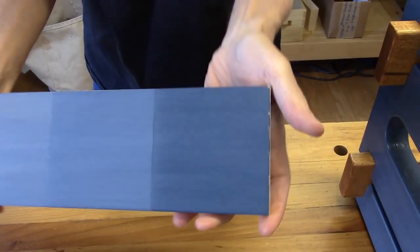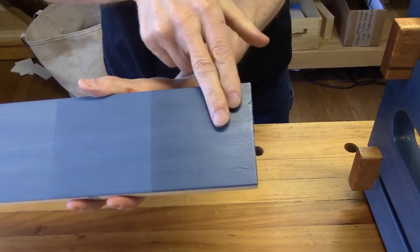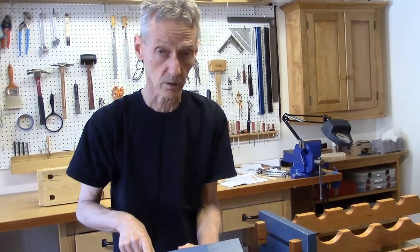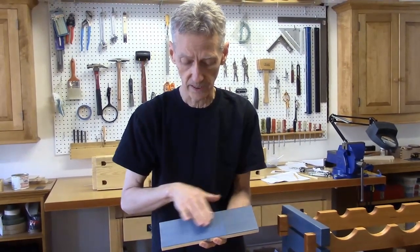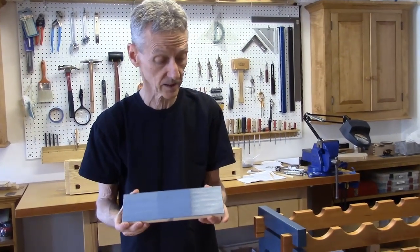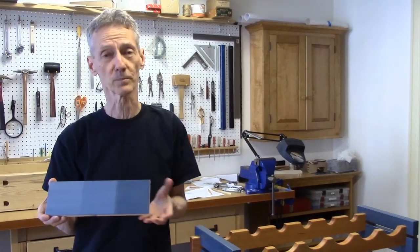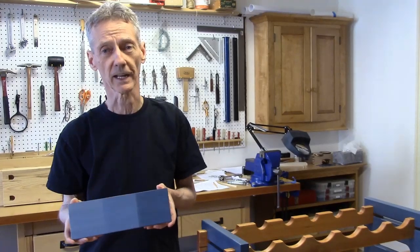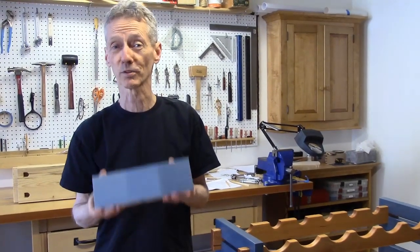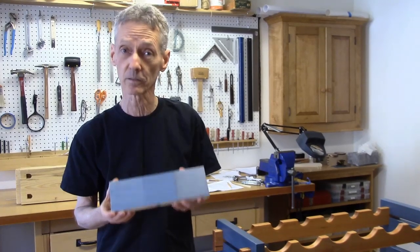I'm trying to get a sheen to appear — can you see it? That deepens the color and also makes it more of a washable finish. You can also put one color as a first coat and a second top coat, and then as the top coat wears through from daily use you get a neat look where the first coat shows through in certain areas. Now this stuff they used to think was about five or six thousand years old because they saw it in the Egyptian tombs, but they've recently discovered in France cave paintings that go back 20 to 25 thousand years that are milk paint. So it's prehistoric paint — even Neanderthals were having fun with milk paint and using it in their little craft projects.